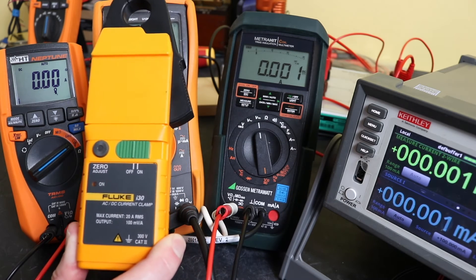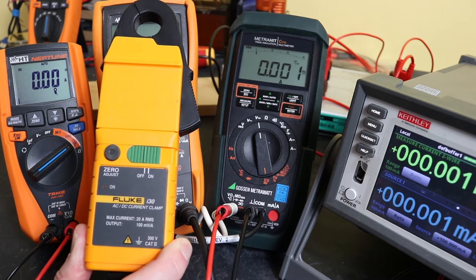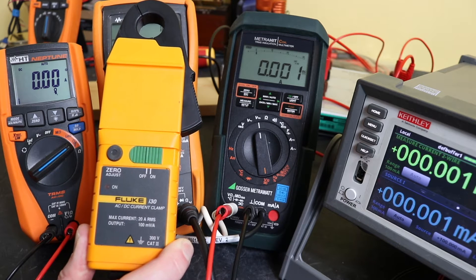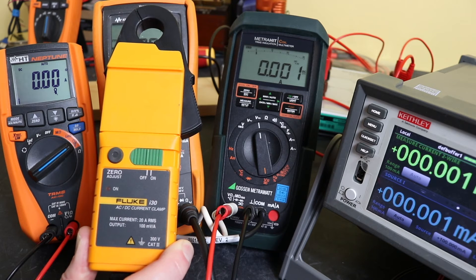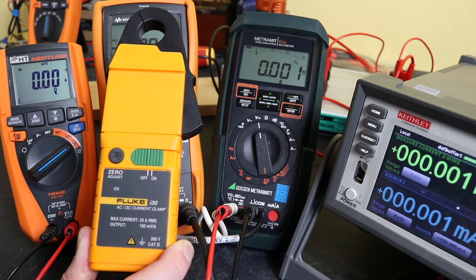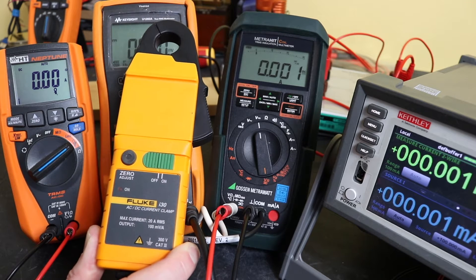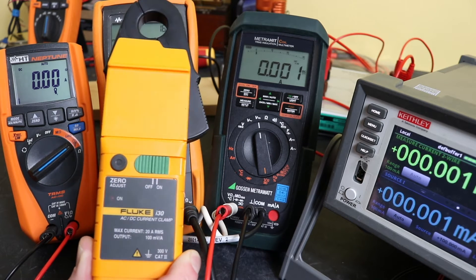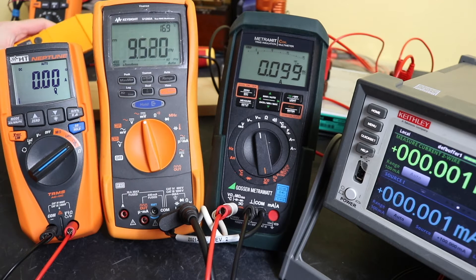For the rest of the specs: on AC amps it will read 0 to 30. It has a 1 milliamp resolution, however it's only specified to measure down to 5 milliamps, and it has plus or minus 1% plus 2 milliamps accuracy. In comparison, the HT4006 had a 10 milliamp resolution, was specified to read down to 100 milliamps, with plus or minus 2.5% accuracy. So we'll switch it on and go through the zeroing.